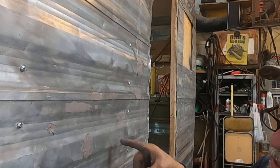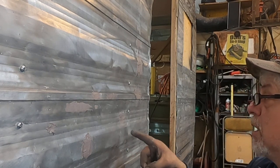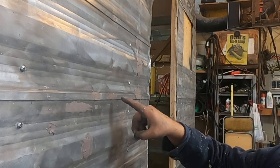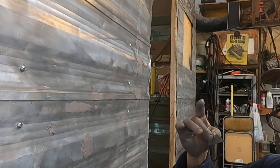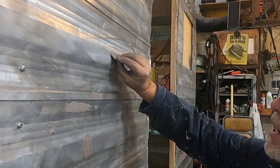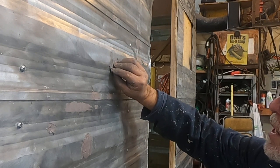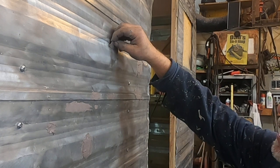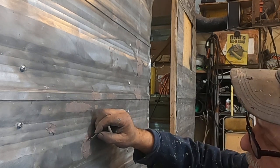As long as your base is clean and you've used lacquer thinner against the metal and you put a little mushroom behind the hole. Now, going into a dent is different than filling a hole. Filling a hole, what do we want? We want a mushroom behind it. A dent, we just find our straight edge here, and we come straight down, straight across, and we stop again. Let that set up, and then we back into there. Very simple. Ugly as can be, but very simple to do.